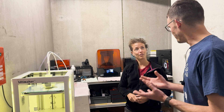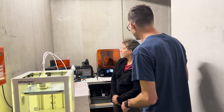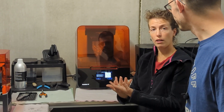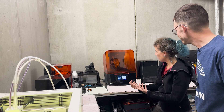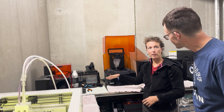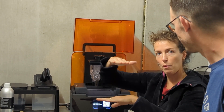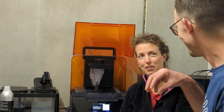I have a filament deposit printer. What is that? That's what this is — we're using plastic filament here. The orange ones are resin printers, which means there is a bath of resin underneath, which is a liquid monomer, and then there is a strong UV light underneath. The bottom of the resin tank is transparent so the light can get through and polymerize the lower layer of monomer. Then the platform slowly moves upward, picking up all these layers of polymerized material.